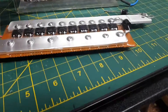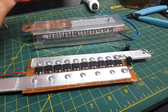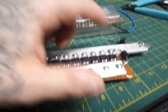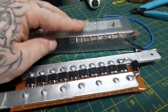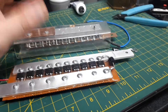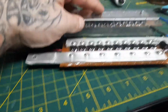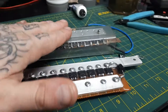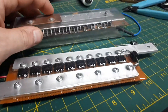After some research, it's better for my builds to use a diode to direct the back EMF rather than block it. For example, the MOSFETs in these prototype welders have a breakdown voltage of only 40 to 60 volts, while back EMF can be something like 1000 to 2000 volts. So in one weld, at least a couple of the gates blow — the welder's done.